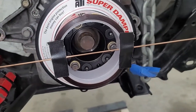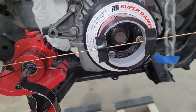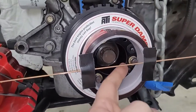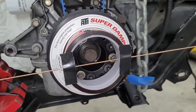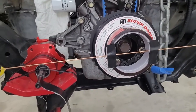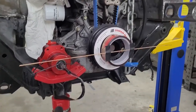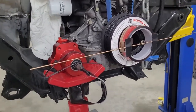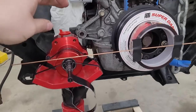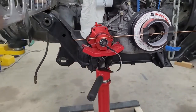In both cases I can slide the pulley up and down on the shaft a little bit, and same on the mandrel I'm building — I'll leave a little wiggle room so I can move things a tiny bit. If you really needed to move things more, you could put spacers behind the mandrel that bolts here. We're going to design it with a little room so that one or two millimeters doesn't break it — we'll have some adjustment, get the stuff built and machined, and then put it together.